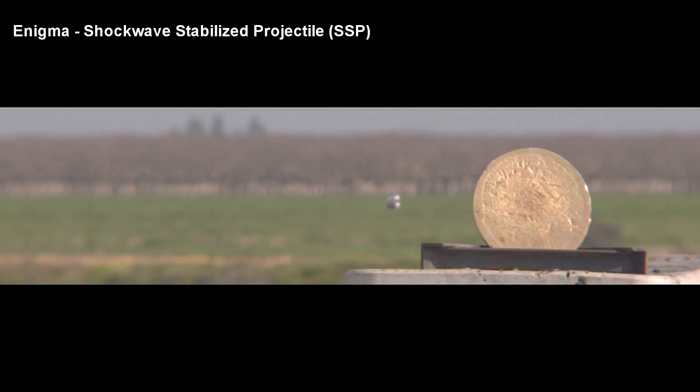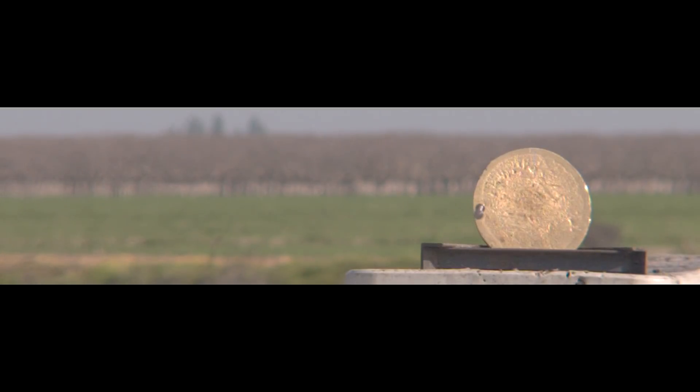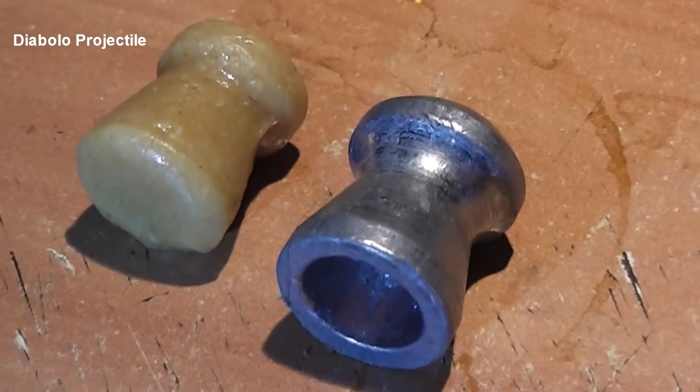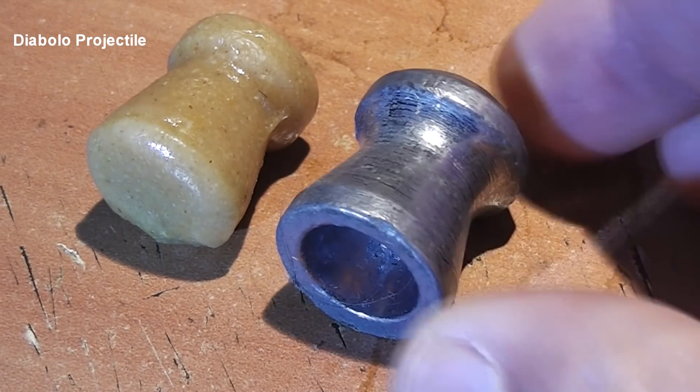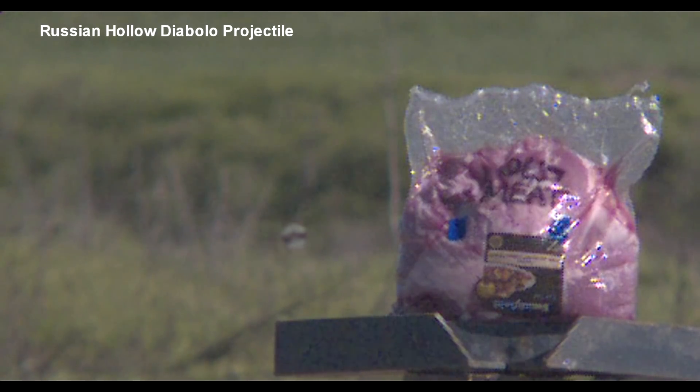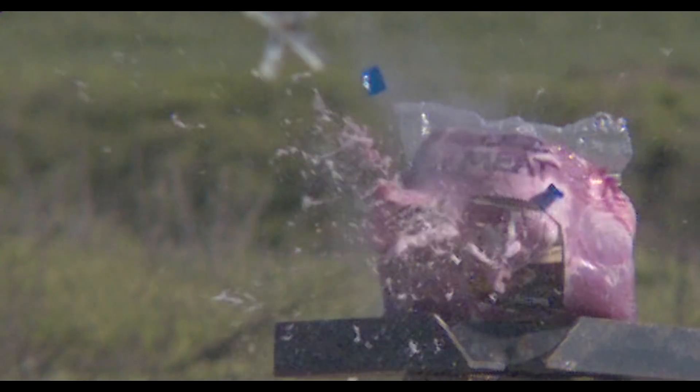Evidence of this is seen by how the tail kind of bounces off an invisible wall and corrects itself. Another interesting thing we've learned is that the Diablo shape, often used in air rifle pellets, can actually be completely solid without that large cavity that makes it very nose heavy. These also obtain stability through shock wave stabilization. But at subsonic speeds, that's where you would need the nose-heavy configuration. And if you use computer models for your design, you can actually create a Diablo projectile that is both stable without spin or without that supersonic waggle.